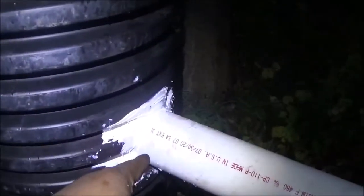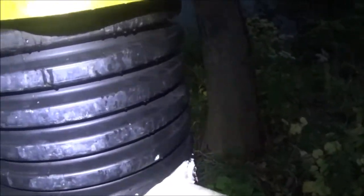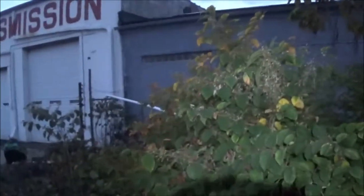The weep hole is there, and it would shoot out of that weep hole when that pump comes on. Now, if you look at that side there, the reason this works, as long as that part right there is higher than this part right here, that's coming out, then it will work. If this part right here is higher or just as high as that section over there, it won't work, because the water will come up and find an equilibrium. So you got to always have the entrance being higher than the exit.